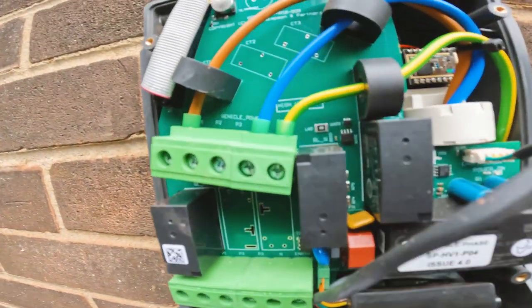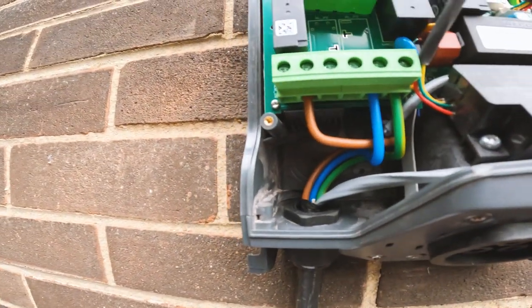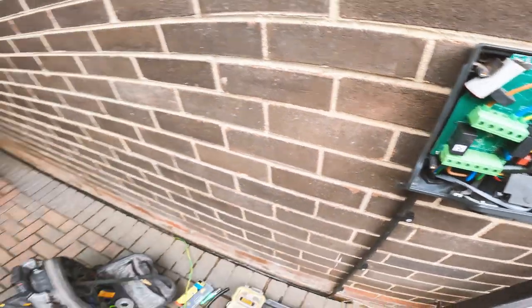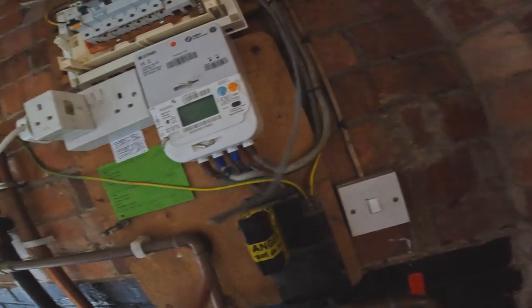Here we go — we've got P1, P2, P3 terminals but this is single phase so it's only P1. We've got line one, neutral and earth — all wired up. Now we're going to power it up and look at doing the wireless CT setup. Not a lot of companies do wireless CTs so it'll be interesting to see the setup. That's the data cable within the EV Ultra cable — we could wire a hardwire CT, but we just had the EV Ultra cable with us, so we'll have a go at the wireless setup and see how that looks.